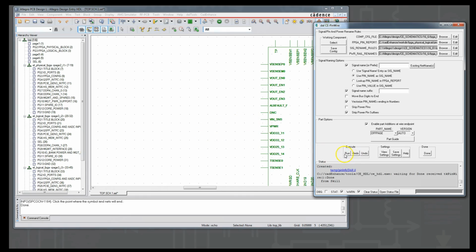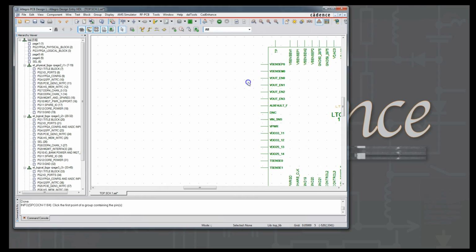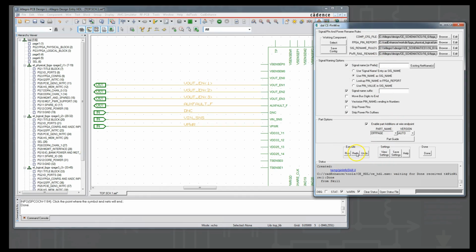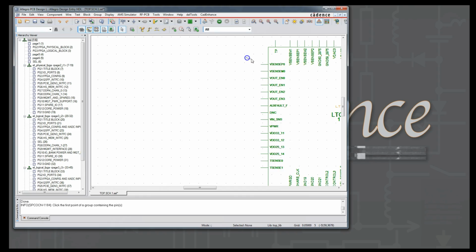If the box you defined does not include all the pins you want, continue providing the 3 mouse clicks anyway, and then use the Undo button to delete the wires you added, or use Redo to delete the wires and redefine the pins and termination point with 3 new mouse clicks.